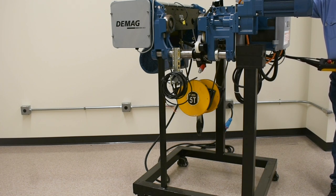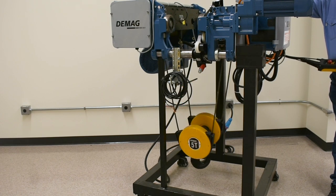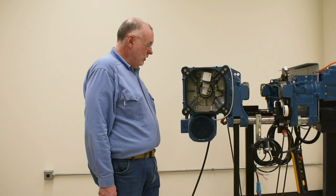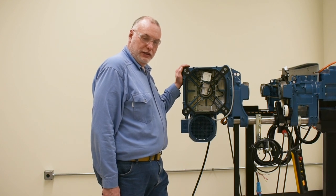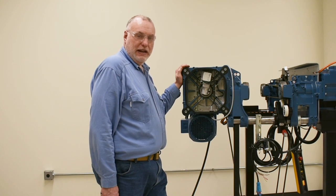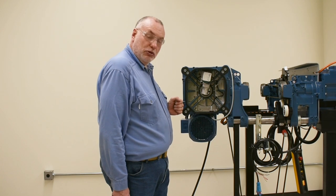There is also a slow down and stop on lowering. To adjust any of the limit switch positions is a relatively easy method of turning one adjusting screw with a hex wrench. We've opened the cover on this hoist to show you the geared limit switch in the housing where it's mounted. The hoist is electrically disconnected to be able to do this safely.